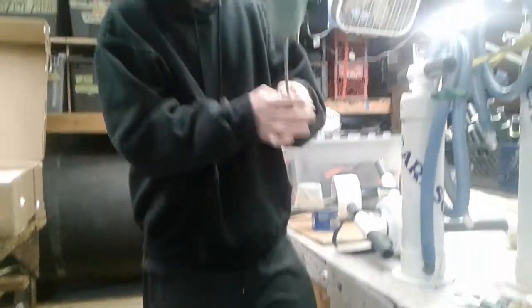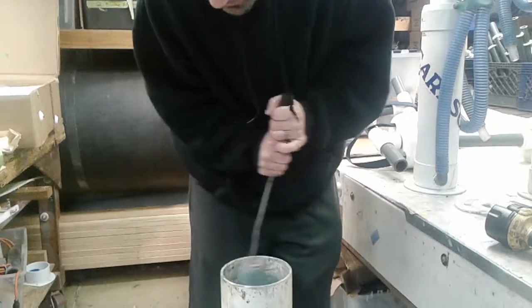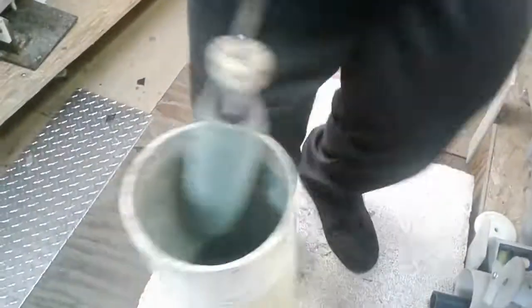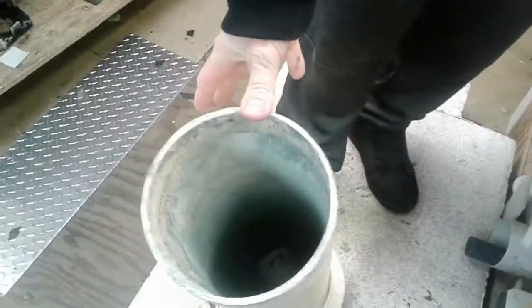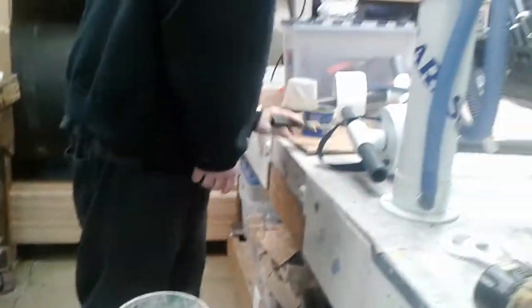On top of the roller — just bend the roller straight — we'll lube that up with marine grease, dip it down inside the cylinder, get it all nice and round. The inside of your cylinder is coated once again with a nice thick marine grease film.